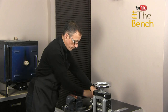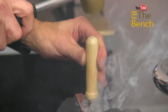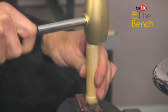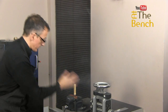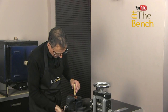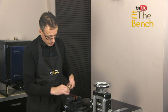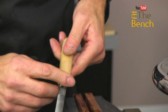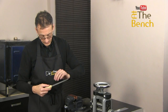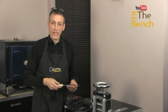Okay, here we go. Do this in a well-ventilated area. You can see — there we go — we've got a lot of smoke. Hammer, hammer, hammer this down. And the file handle has gone all the way down. Do this in a well-ventilated area, not in a confined studio like we've got here. The file will not be hot because the jaws have taken away some of the heat. And you can see how we've got a nice gorgeous fit on our file — it's gone right down to the end, the handle is nice and central. A little bit of wood resin has come down — that'll just wipe off. And that is the correct way to attach a file handle onto a file.